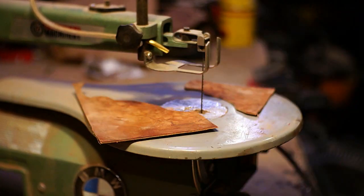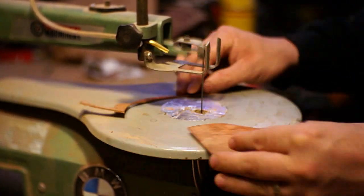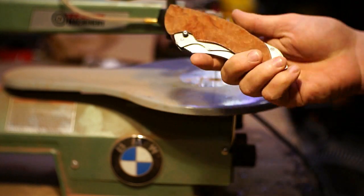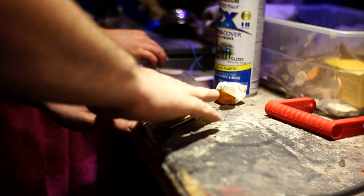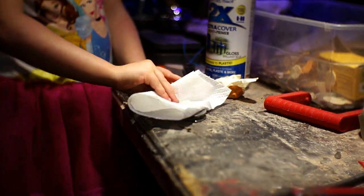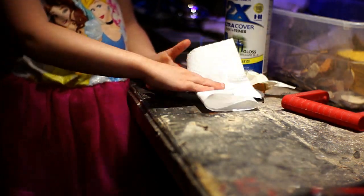The easiest way I found to cut this stuff out is just to run it all through the scroll saw. You can get through it really quickly and get it relatively close to the dimensions I wanted before putting it on the knife, then sand it out to get the final fitment right. Surface prep for the epoxy was especially important on this one because with the liner lock there's a piece of metal moving back and forth, and I was worried that over time that might deteriorate the bond. So I made sure to give it a lot of good tooth with sandpaper and then cleaned it off really well with acetone.